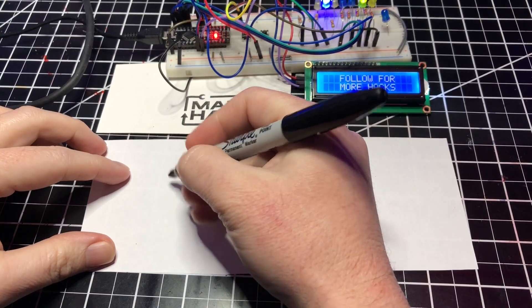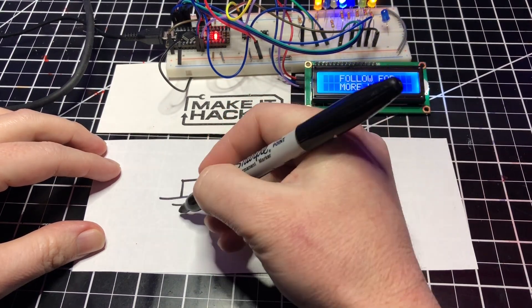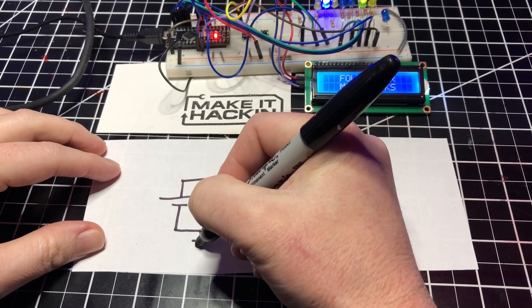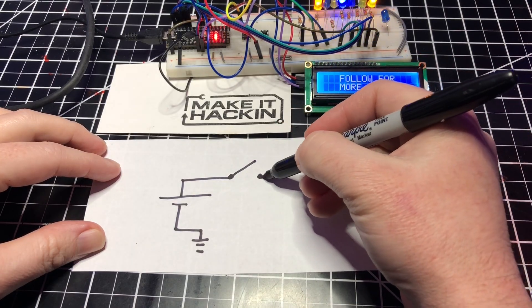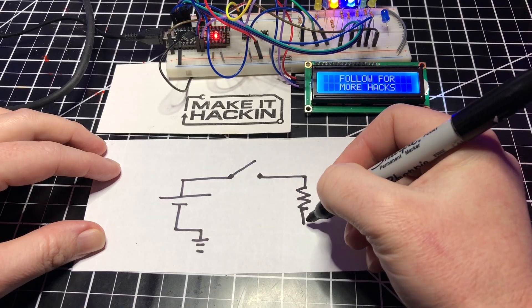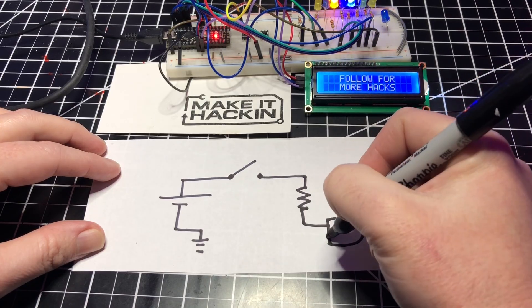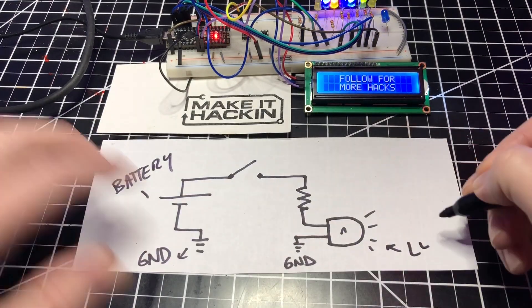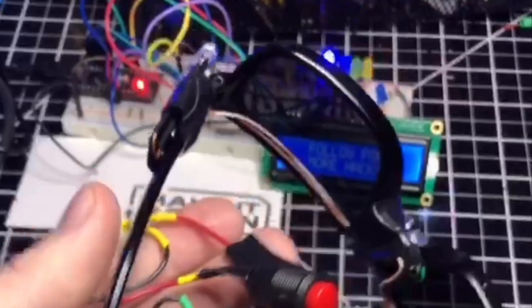It's like if someone were to shine a flashlight in your face — you can still see, but you only see a very bright light. Now that we know how the camera works, let's take a look at the camera blocker and start by creating a circuit diagram. We need a battery that will power the circuit. The top side is the positive voltage and the bottom side is ground or negative voltage. The positive voltage runs through the switch indicated by these lines here, then through a current limiting resistor indicated by these zigzag lines. The value of the resistor depends on the battery voltage and LED specifications. After the resistor, the voltage runs through the LED causing it to illuminate. Here is what the LEDs look like when soldered to the resistors — this example is for the camera blocking sunglasses that I made.